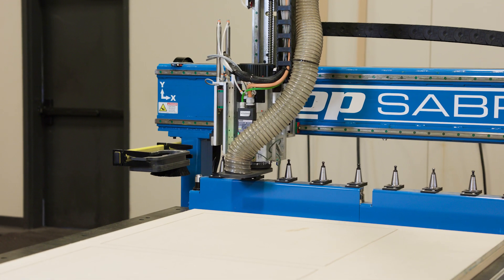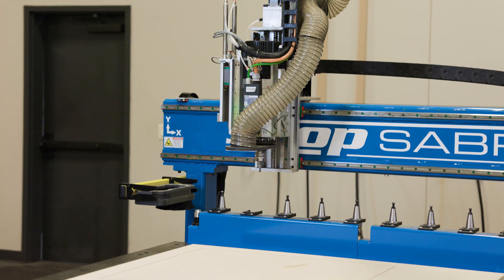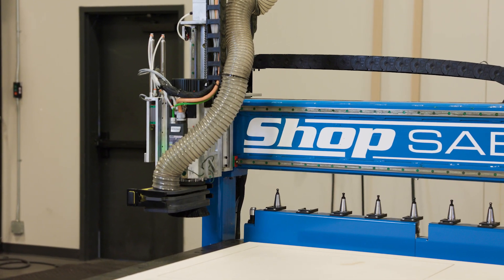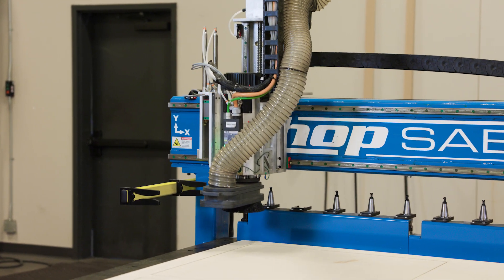Alright, that's a lot of tools. Thank goodness we've got an automatic tool changer on this machine. I tell you right now, if you're looking at a new machine and trying to decide if you need one — if you're going to use more than a couple tools, it is well worth the investment to do it up front. This thing's going to save you a ton of time. You'll load them up, measure all the tools, and everything is stored. Now let's see this thing in action.